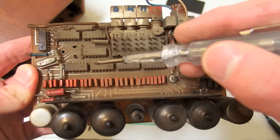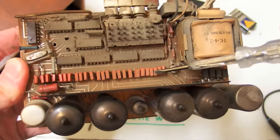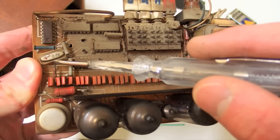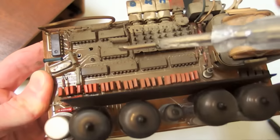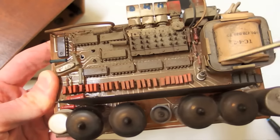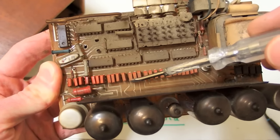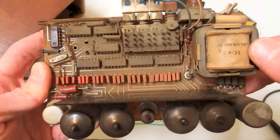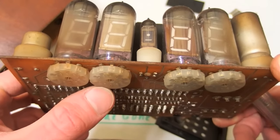There are eight CMOS chips — some early Soviet CMOS ones — and a lot of transistors. Each transistor drives one segment. There's the crystal, also dated 1978, and this is probably a crystal oscillator. There are base-10 and base-6 counters with direct 7-segment outputs. Those outputs go into the transistors for high-voltage switching, which switches the segments of the tubes. The tubes run at about 27 volts on the anodes and grids, while the heaters run at 1.5 volts.